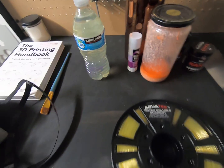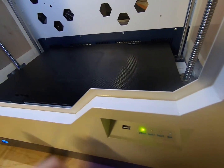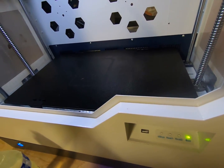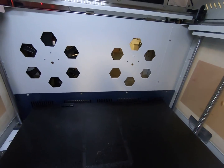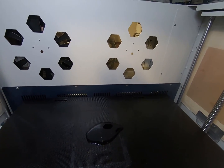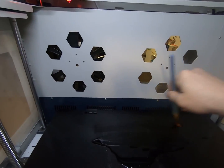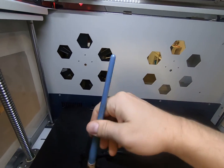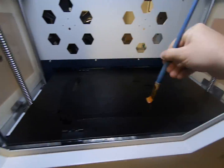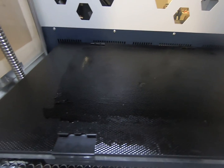Now I'm going to go over to one of our high-temp machines and show you how to apply it. I'm here at one of our high-temp machines. What I'm going to do is pour some of the BVOH slurry — as I like to call it — on the build plate and show you how easy it is to apply. I just pour out a little bit in the middle of the build plate, take an acrylic art brush, and apply it over the area where I'm going to be printing. You can see it's got a nice sheen to it.